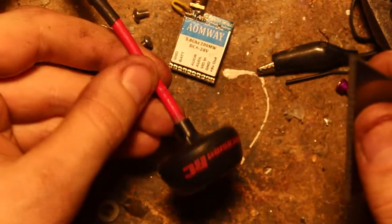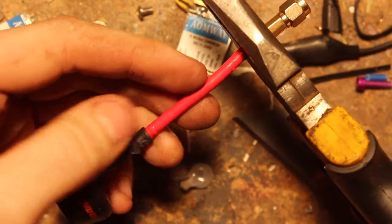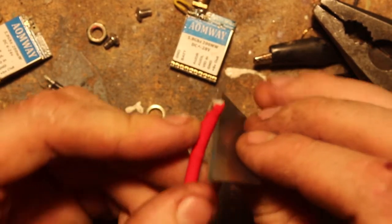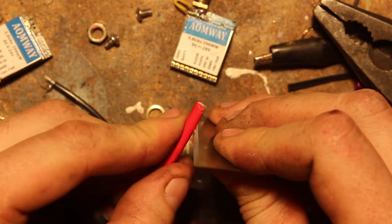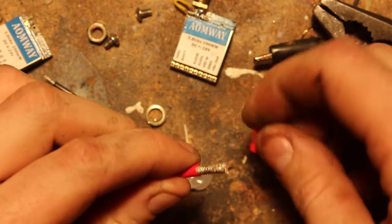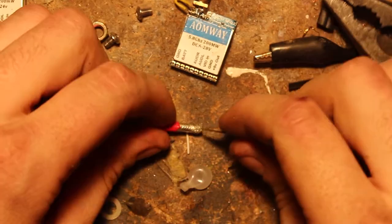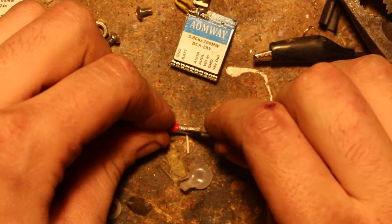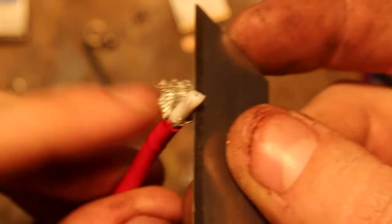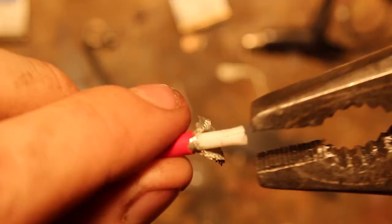So what I'm going to do now is get the antenna I'm going to use and remove the old heat shrink from it. After I pull the heat shrink off, we'll cut the end of the antenna and start stripping it back. Instead of using wire strippers, it's probably easier to get a Stanley knife blade and wind it around — roll it backwards and forwards and then cut the insulation that way.